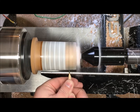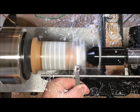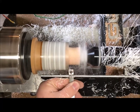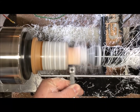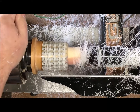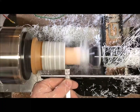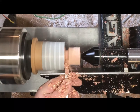I'm going to mark a line on the top to where I think the top of this is going to be, and I'll use a carbide tool to work it down. If it gets a little bit chattery, slow down — your feed rate's probably going a little too fast — so just take slow even cuts. As I got into that crack an explosion happened: it started to chatter and made a bunch of chips all the way around the top edge. I decided I can clean that up and just take it into the tops of the skulls just a little bit — they're just white plastic so it should be fine. Time to just flatten it up, remove that super glue, and we'll be ready to move to the inside.